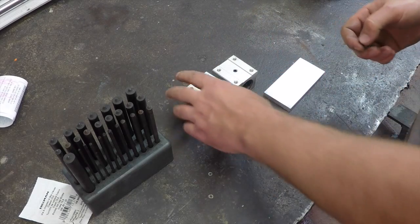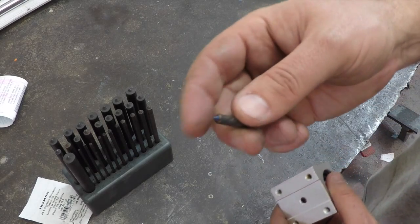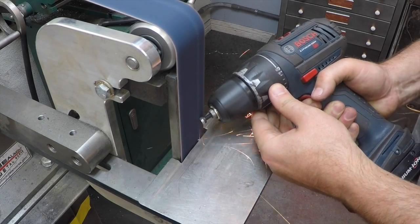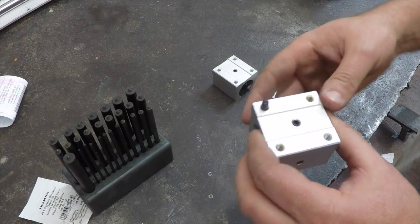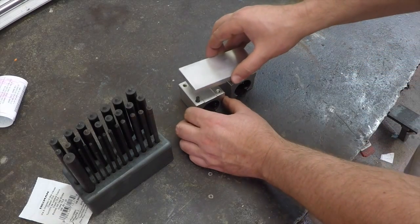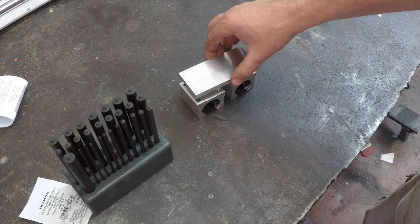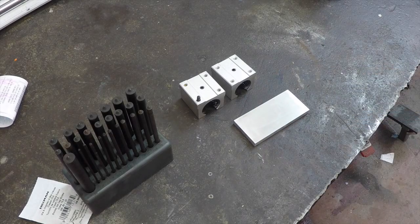One method: they make what I think are called transfer studs. I just made one here — took a bolt and ground the head off on the grinder. So you could sacrifice four bolts, come up with four of them, get them in there, lay the piece on top just right, clamp it or hit it with a hammer to transfer the punch marks, then drill from the punch marks. Anyway, I'm going to do a slightly different method tonight.